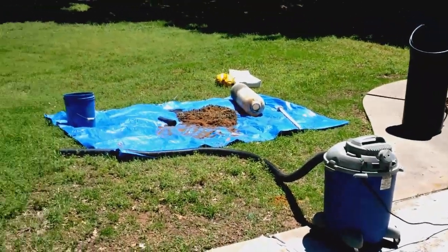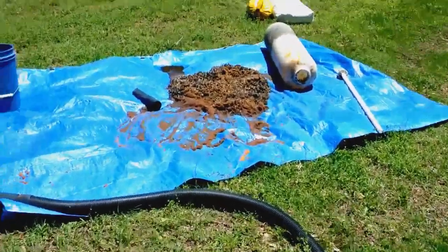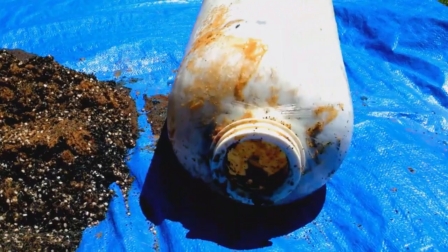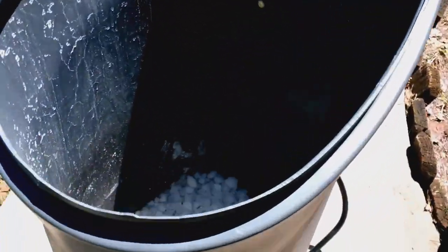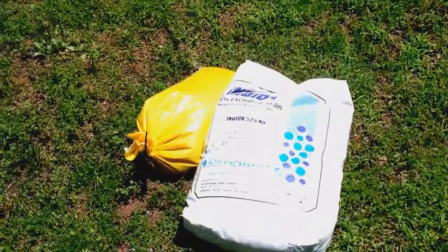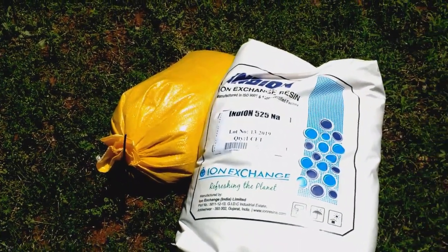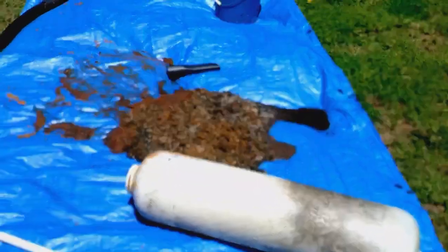This has turned out to be quite a job because to remove the resin, I had to get something to protect the grass. The resin is all full of salt — that's part of the reason you have resin in there, as an ion exchange column to remove the salt. There's what the resin looks like coming out of the tank — it's got some gravel and even looks like it has some charcoal in it. There's the empty resin tank, which I'm going to clean out. The water softener tank has got a lot of salt in it too, so I'm going to clean that out and dispose of it properly. The new resin arrived — ion exchange resin — a 50-pound bag plus a 25-pound bag. I think they do that just for shipping purposes. So I'm going to clean out the old resin tank and put in the new resin.